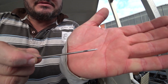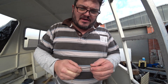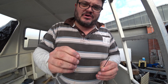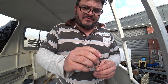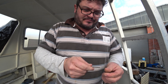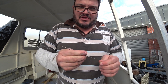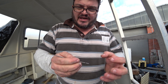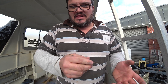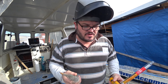That's how I start off with the tip. What will happen as soon as I start to weld is the point of the tip will ball up - the very end of it will melt a little bit and become more round, and we want it to do that. It's only if it gets dirty again, or if I accidentally dip it into the weld pool and aluminium gets on the tungsten, that I have to pull it out and clean it again.